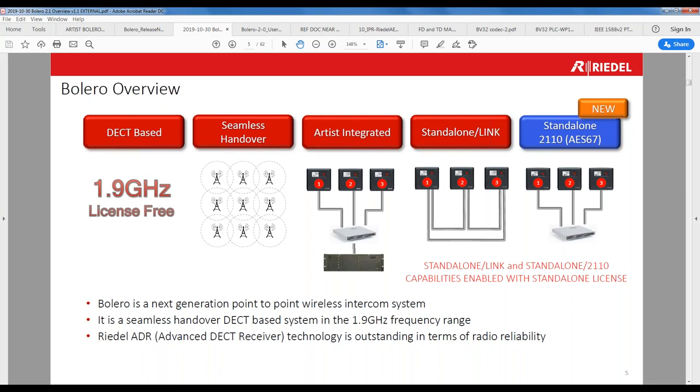We're replacing that with an RF transceiver that serves two purposes. It serves as an RF device in the DECT domain to transmit and receive audio wirelessly to and from the belt pack. And then we're also using that antenna as a network edge device to Ethernet frame and packetize audio from that belt pack and then send it to and from the matrix. Again, it's a proxy relationship. The matrix is doing the routing, the mixing, and the antennas are serving as proxies to the belt packs.